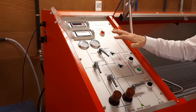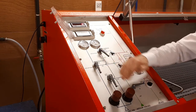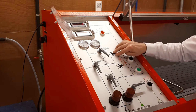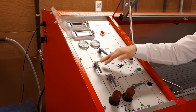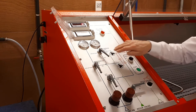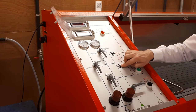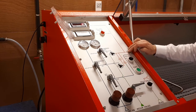To understand the working of the system we go deeper into the scheme on this panel. About the blue lines: as mentioned before we have a low pressure and a high pressure pump. Those red knobs are the pressure regulators to set the air pressure onto the pumps to get the hydraulic pressure on your hose. The ball valves are used for activating the pumps and to control the speed. When the test pressure is reached and the stabilization time is done, the ball valves are also used to isolate the hose from the pump by turning them to the side. Above you see the air pressure gauges which indicate the air pressure on the pumps. And in the middle we have the blow-through line to empty the hose at the end of the test.